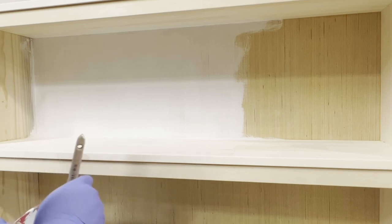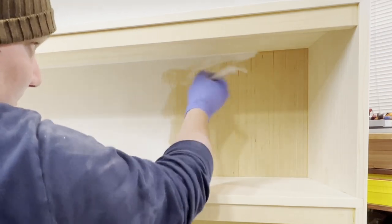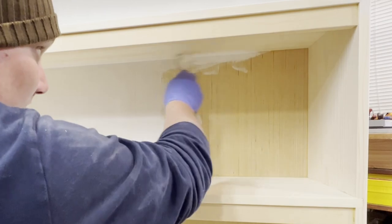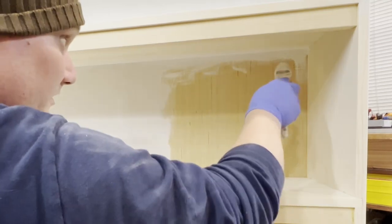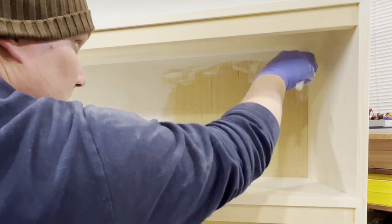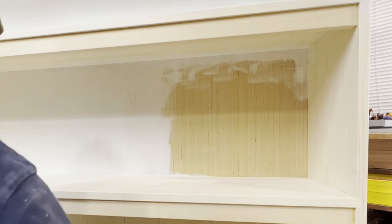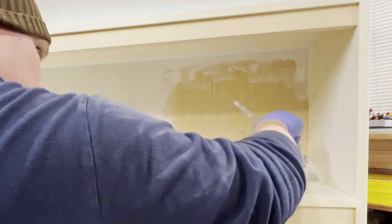And you can put it on. See, like I said, if you were too light with your paint, you might just be fighting the whole time. So I'll add a tip. My tip is keep a healthy amount on your brush. So you're putting on material, and then you're moving it around, you're manipulating it. So that gets the top and then the corners, and then you're checking for runs or heavy spots too. So that's just a quick little painting tip.